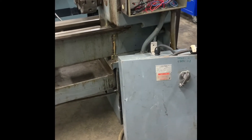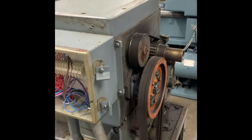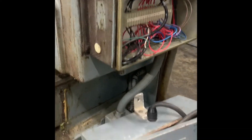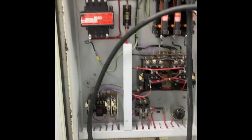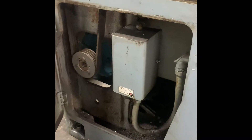This machine was fully functional from a dealer on the East Coast and it did function. Now I already showed you about the timing belt issue, but also electrically — look at what we've got going on here. Here's the original breakout panel, and then we have this additional panel. I don't know where they had it mounted — maybe to the wall — but it came in on top of the machine. So what we're going to do is eliminate this box, eliminate this box, eliminate everything on the front except for the barrel switch, and install a Mitsubishi D series VFD.